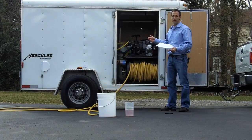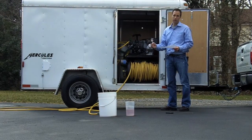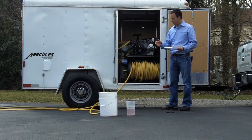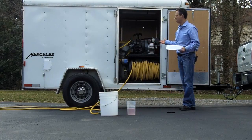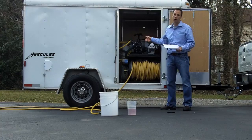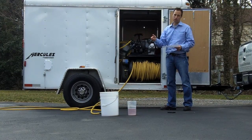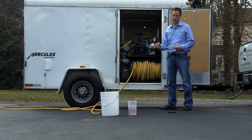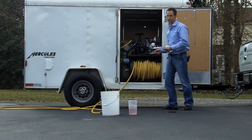So what I have to do is calibrate the pump and engine to spray 48 ounces in 15 seconds. You can use the engine — if you turn the throttle up, you're going to get more volume out of the end of the gun; if you turn the RPMs down, you're going to get less volume. I recommend running your engine just a little above idle so it basically lasts forever. Do most of the work out of your pump by turning the pressure regulator up to get higher volume and turning it down to get decreased volume.